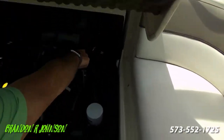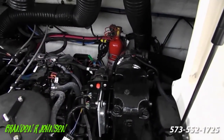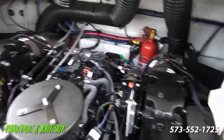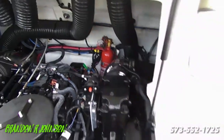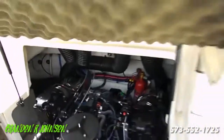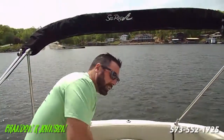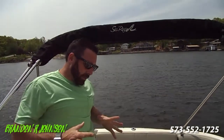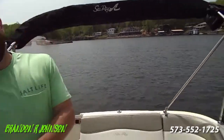Back here, you see the shiny things there and there. When we switch our exhaust, we're choosing how the boat pumps out the water that it brings in to keep the motor cool, as well as pumps out the exhaust. If we're going to try to switch that when we're going fast, there's a lot of water and exhaust going through there. What turns the flaps inside — which we cannot see — is thinner than a pencil; little lead bars. So if we're going fast and we switch that, we put those in a bind and break them. Switch them at idle speed only.